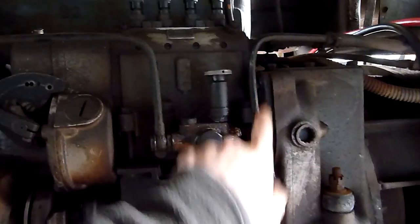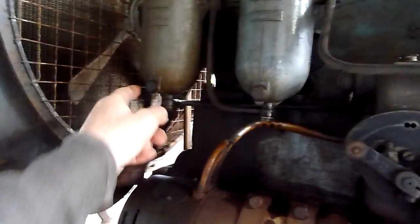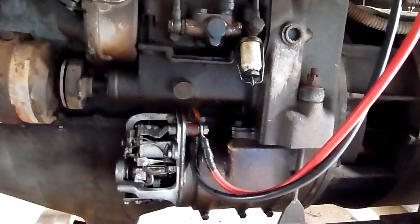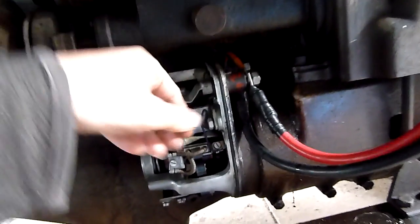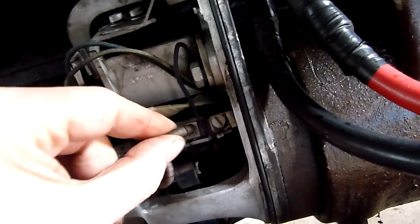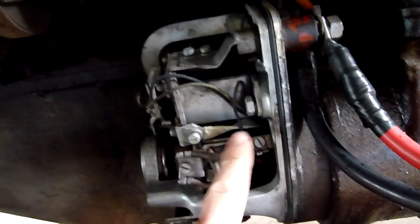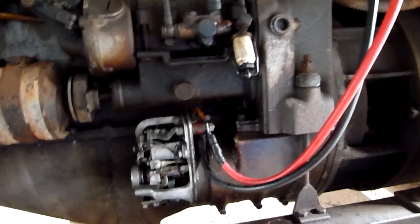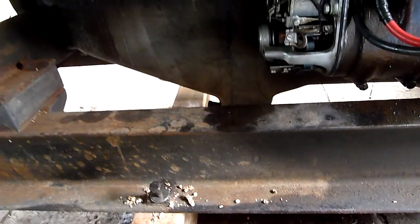I'm also flushing fuel through. I've primed everything — there's a primer there — cleaned the primary strainer. The primer itself leaks fuel; everything leaks fuel on this thing. I've pumped fresh fuel through, cracked all the drains, and got just a tiny little dribble of water and mud in the bottom of them, probably from decades of neglect — no major water. I fitted new battery cables, cleaned the starter up, and washed it out with naphtha and compressed air since it had fuel dripped through it over the years despite the rubber O-ring.